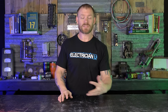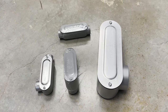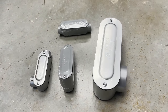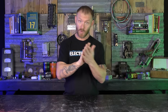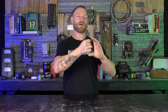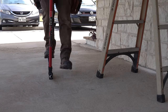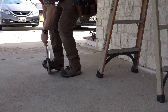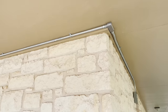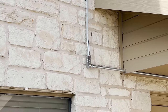For those of you who don't know those terms, a conduit body is basically a small transition junction-box-looking conduit raceway thing. It's got a removable cover - not meant for twisting joints - it's more meant for having a pull point in between two different things. So instead of trying to bend a crazy 90 around the corner that sticks out, I just hugged the corner really tight. Put the LB on one side, do an LL and LR, and just make everything really tight and straight.